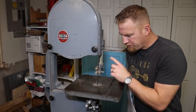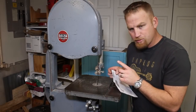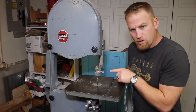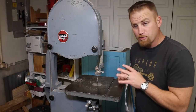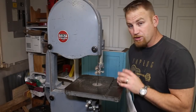The last thing I did was order a new blade for this — a three-quarter inch Timberwolf blade, 3 TPI. Some subscribers recommended I go with a higher quality blade and it would get a better cut, and they definitely were right. That combined with the new motor made the world of difference. This has no problem now going through thicker material and cutting through almost anything. I'll show you what that cuts like.